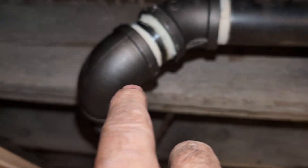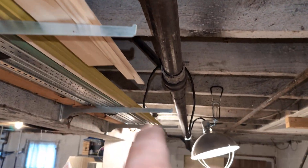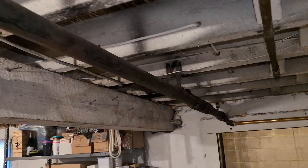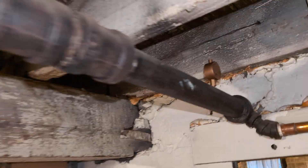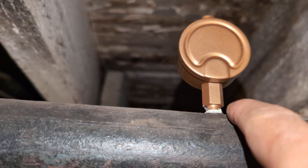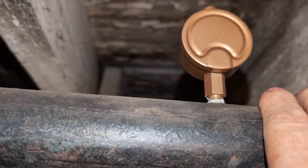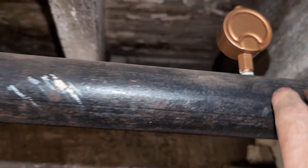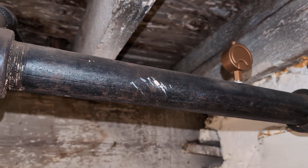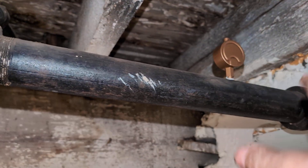This is the long main — it goes to the end. We have drilled at the top of the main and installed a vertical vent. This is a number six right now, and that's what we really need for this size. We might increase that to a C — the next one up would be a D.